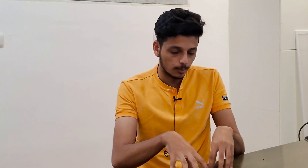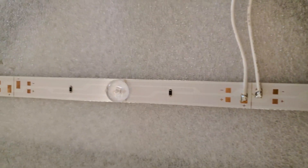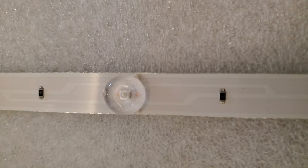In the case of a signage module, you'll need a minimum of 6 inches and above for a uniform light spread. To make a box with a depth of 6 inches takes time and costs a lot — the deeper you go, the more complexity in wiring and the more it will cost you. The minimum depth requirement for a rigid bar is only 3 inches, and due to its special 170-degree angle lens, it uniformly spreads light within that 3-inch range.